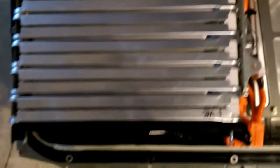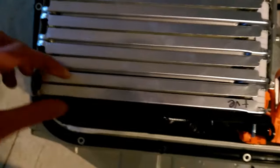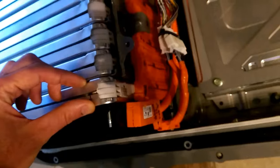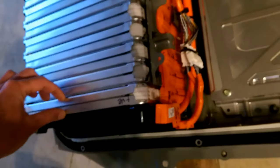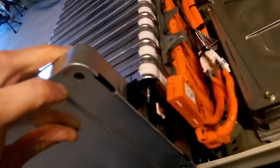Here you can see the gen 2 cells — modules I should say — and it's quite open, quite exposed. Inside of that are two in series, two in parallel cells. There are quite a few places where people have ripped them open to show what's inside; try looking for endless sphere forums for example. By contrast, here is a gen 1 module — it's solid, like a baked bean can or sardine can. This one seems to be a lot better sealed, although it's still not actually fully sealed. If you get something in there it's going to be harder to come out, whereas with the gen 2 if you get something in it comes straight out the other side.